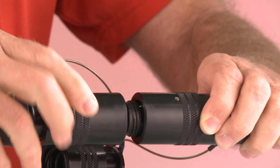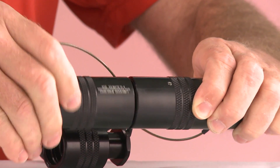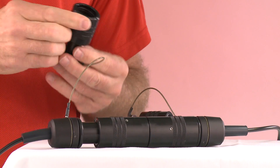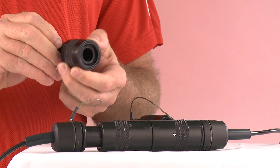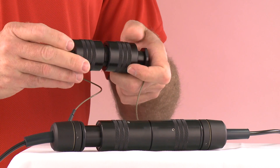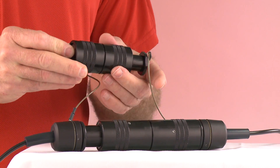Based on the hermaphroditic design, EasyMate connectors allow for quick deployment and gender-independent connectivity, permitting the end user to unreel fiber cable without regard for male or female ends. This enables the transmission path to maintain polarity even with multiple cable segments daisy-chained together.